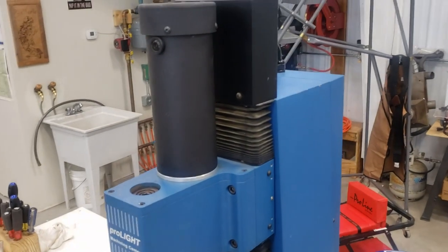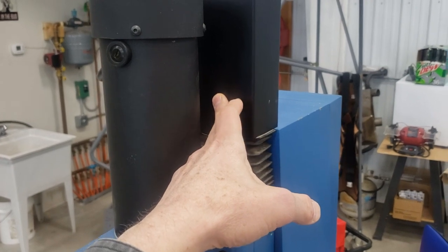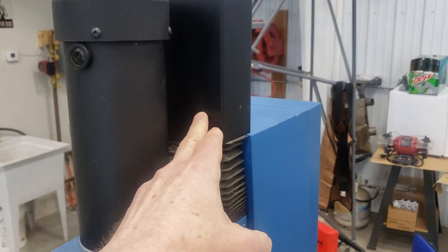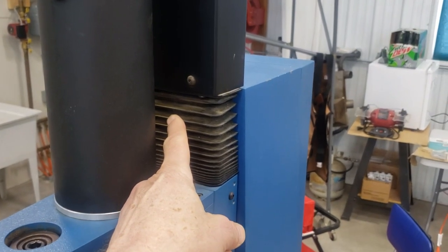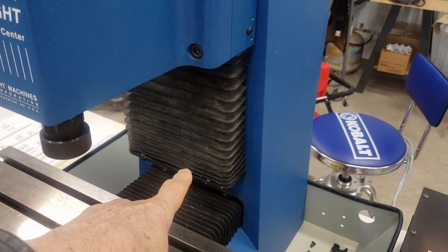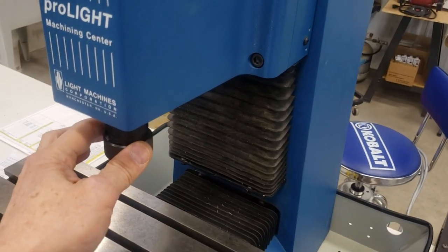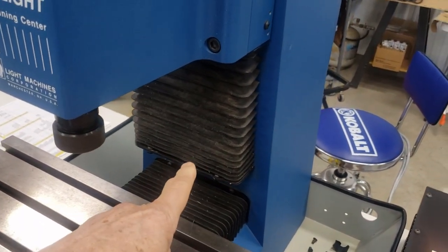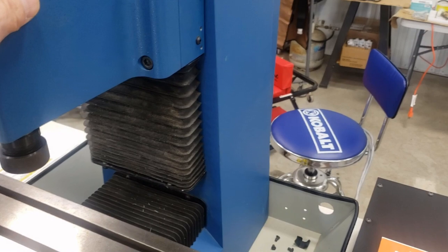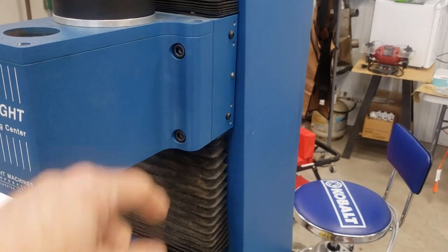The layout of this machine is pretty straightforward. We have an 80-volt motor. In this box here we have a gear reduction with a stepper motor — the stepper runs on 24 to 48 volts, and we're running it on 48 volts. In the bellows is a micro switch, which is the home switch for the Z-axis. At the bottom of the bellows there's another micro switch — probably unnecessary, because when you start to lower the spindle, the Boyer Schultz will hit the tabletop before it ever triggers that lower micro switch. These controls, both for the Z-axis and the two micro switches, come out of a DB9 cable on the back of the unit.